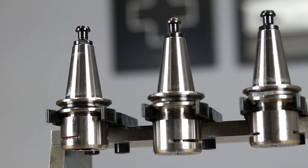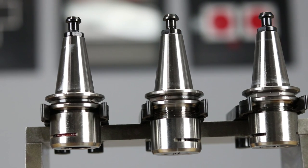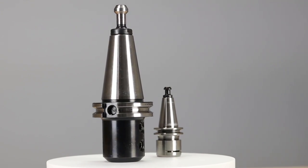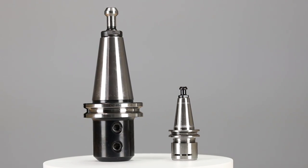We're only going to be using a few different end mills, so we wanted some type of a tool changer. We didn't have the budget for a carousel style tool changer, so the boys over at Sile put this together for me — a little wine rack style tool changer. These are actually just little itty bitty ISO 20 tool holders — literally the size of your finger, micro mini. You can see here we're comparing it to a CAT 40 — it's actually hilarious. We'll probably never use an end mill bigger than 3mm for what we're doing.